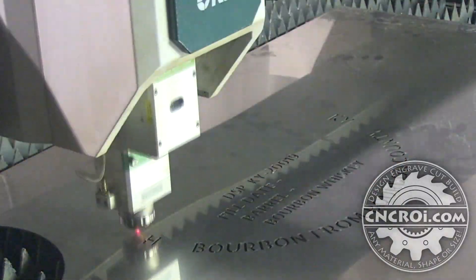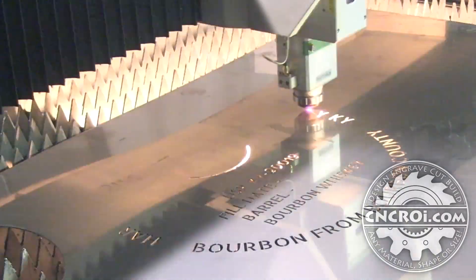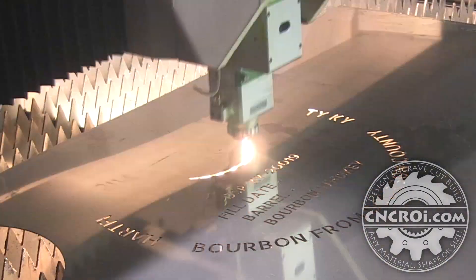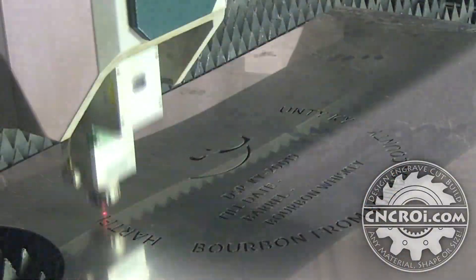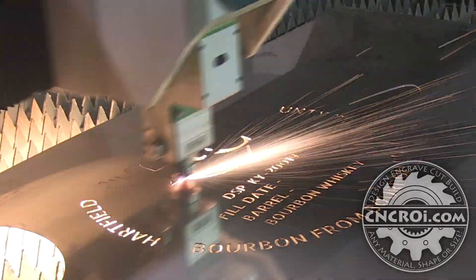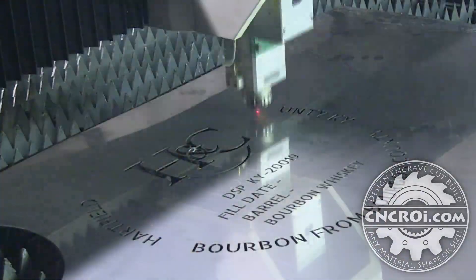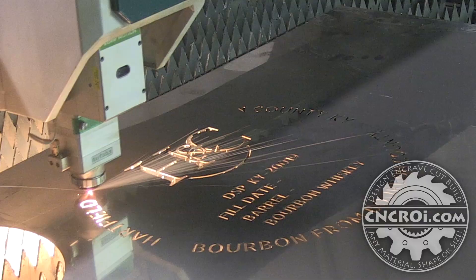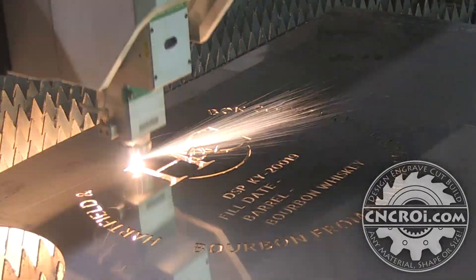You can see in this one here the fill date is a little bit off. It's easy to see on the video that it's off, but it's really hard to see during production that something like that has happened. You don't see any movement of the sheet — maybe a little bit of stress got released a fraction of an inch, and it goes across the whole sheet. You end up maybe a sixteenth or thirty-second off, and it just builds up and produces an uneven result.